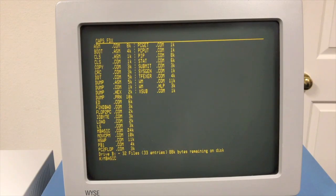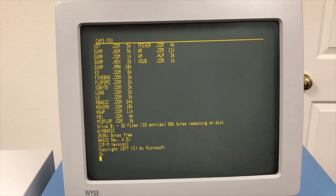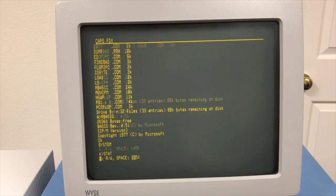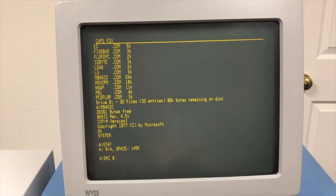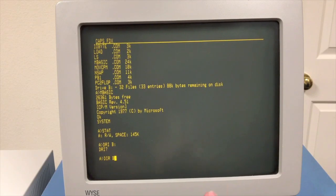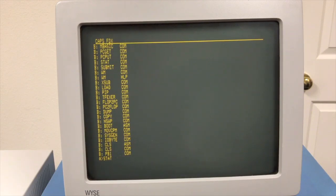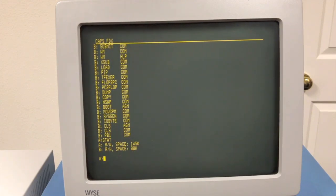You can run MBASIC. Of course in the CPM days you had BASIC, just like Altair or DEBI, but then you also had CPM — equivalent to FDOS or AltairDOS — to allow full development, all much more nicely integrated. This will show us our two disk sizes. These were standard IBM disks — got about 256K. Your system is up and running CPM nicely.